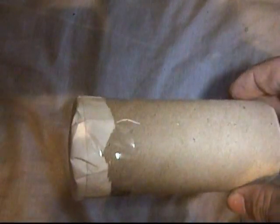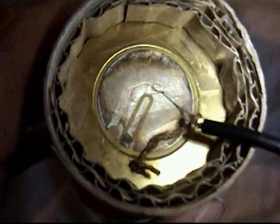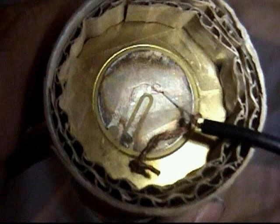Okay, this is my microphone closer up. Sorry if it looks a bit dark — my camera kind of sucks. And I know it sounds like I'm recording outside at the moment; that's my fan blowing into the camera's microphone, there's not much I can do about that. Anyway, this is my microphone. It has a paper diaphragm at one end and a piezo speaker at the other. There is also a rod that connects the speaker and the diaphragm together.